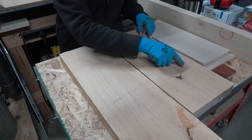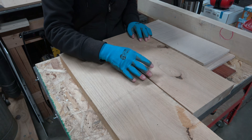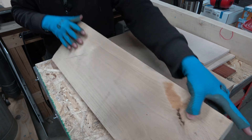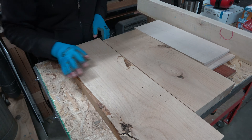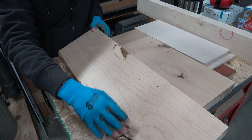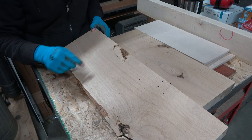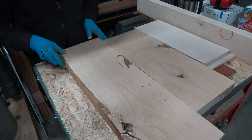This flaw up here is inside the cutaway, so it won't intrude. There is some cracking and splitting here, but that shouldn't be an issue because I'm going to put a top on this guitar. On this other piece, I have a flaw up here, but once I prepare these and cut them to length, that whole section will be cut off. But on this side things get really ugly — I've got a sheared-away section, a big crack and crushed flaw, and another problem up in here. Again, I think this is all going to be cut away where the contour of the body curves in toward the middle, and this edge should be cut away when I cut this to width. So I think I'll be okay.